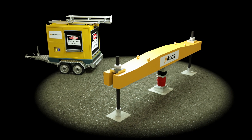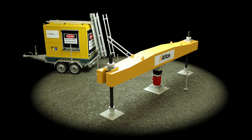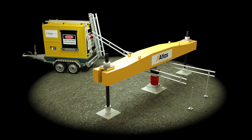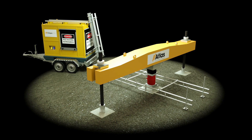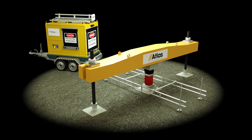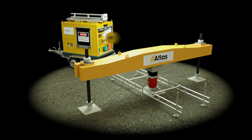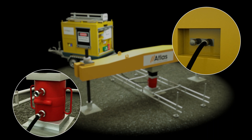Test setup is quick and easy and can be achieved in less than 20 minutes. A roof mounted reference frame is used to mount the pile displacement sensors. Six quick fit truss frames, four height adjustable stands and four snap lock bracings combine to create the reference frame. Two feed and return hoses with quick couple unions and threaded taper lock unions attach to the jack.